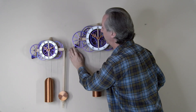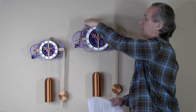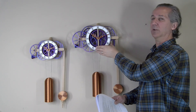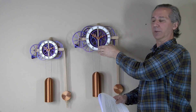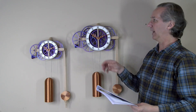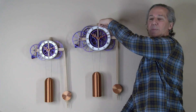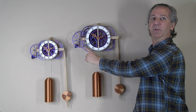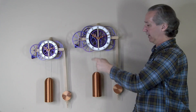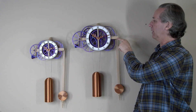There's also an overall better winding key mechanism, and additional bearings have been added to the ratchet and behind the minute hand arbor. So instead of five bearings this new design uses eight, although you can still build it with the five bearings included in the original design. I think the ratchet and the back of the minute hand arbor are minor wear points. Everything that supports a weight, like the winding drum, always had a bearing and still needs one. There's also a bearing in the pulley, in the weight shell, and in the pendulum arm.